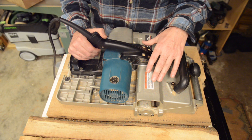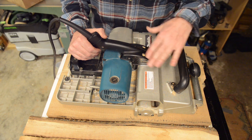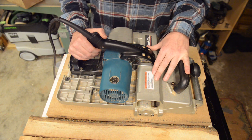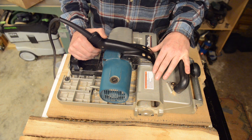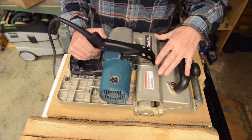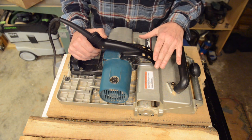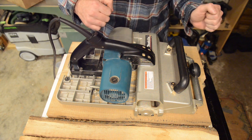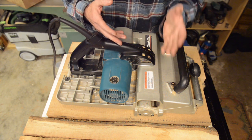It's a little over 12 inches wide in terms of the maximum timber width it can plane, but oftentimes you're not dealing with a 12-inch-wide timber. It's really nice to have a unit that's wider than the timber you're planing, because you can actually skew the whole unit as you're passing it along the timber — much like somebody experienced with a hand plane would do.